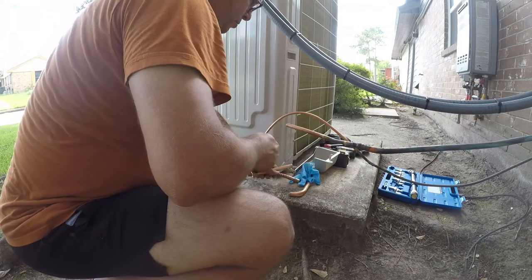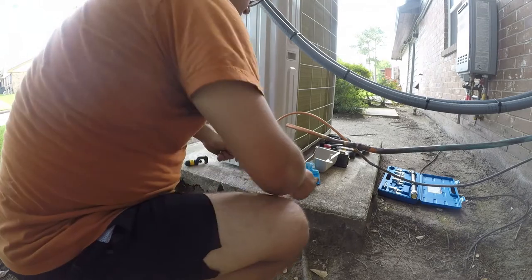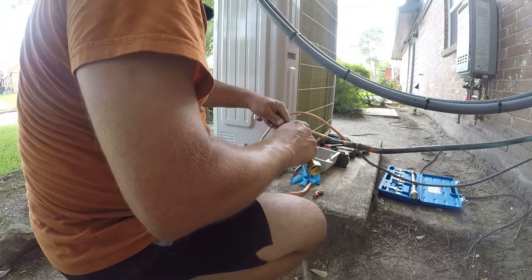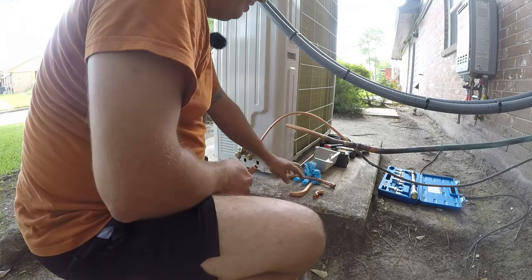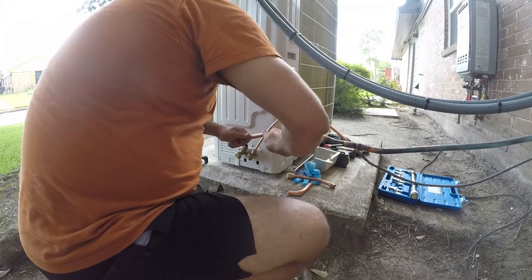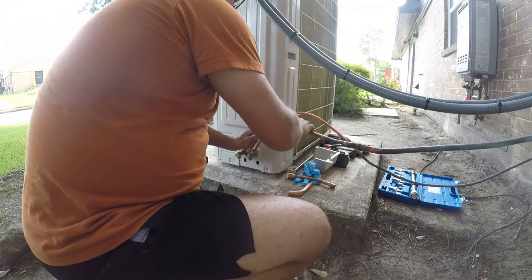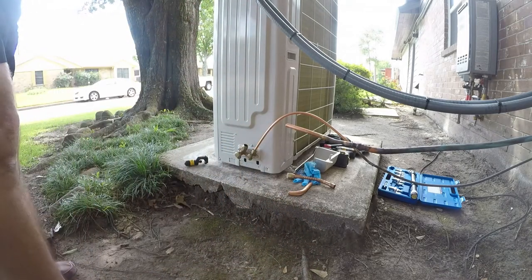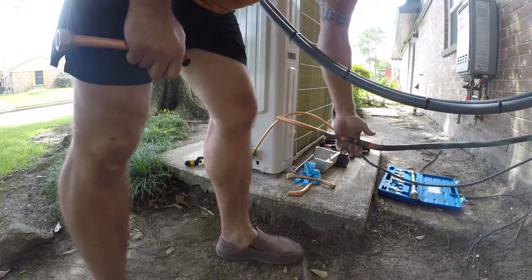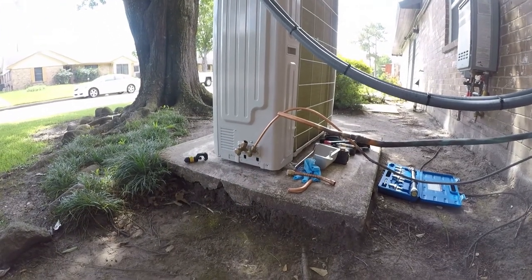And again, this is the thing that's weird, is like, this seems to go out. No, it doesn't even fit that. I don't know what the hell it's for. I really don't. To me, this is a mistake. If you can't, they've overexpanded it. And it's just so close. So the right thing to do is to unbraze it here and braze in a new piece. So that's what we're gonna do. Let me go get my brazing rig so I can take this apart.